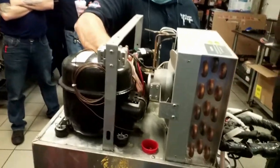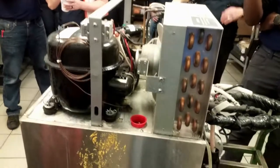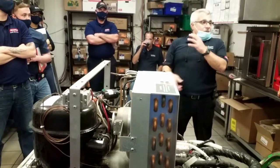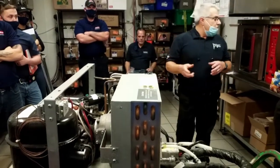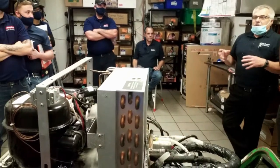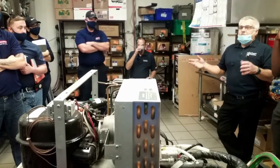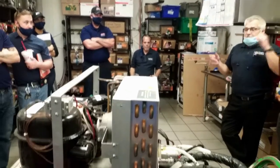There's an agitator motor in the middle, which hangs down into the middle of that water bath and has a little propeller on it. It's constantly spinning to keep that water agitated in there. If it doesn't keep it agitated, when that thing runs and it brings in warm water, you're going to lose contact with the cold water. And it'll end up flat and warm. Just without that little propeller going, it'll cause a problem.